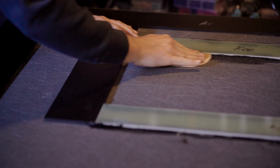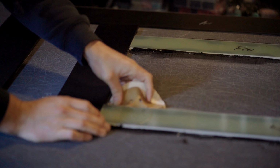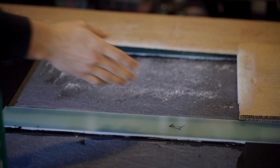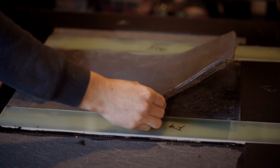For the areas that have Sikaflex overflow, I needed to sand those down a bit in order to get the glue to stick. And to glue these down, it's all the usual suspects, folks. Our good friend 3M90 back again. I used a cardboard box to block off the area, and just like we always do, sprayed both sides, waited for it to dry, and then stuck them together.